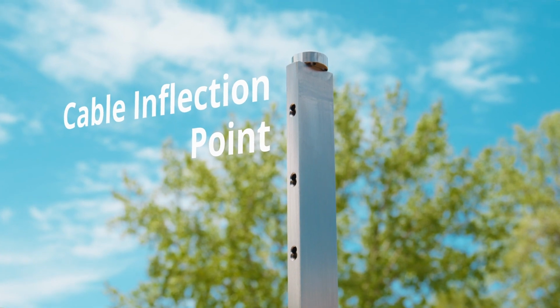Let's take a quick look at installing handrail on stairs. The biggest concept to remember when installing your stairs is where to make your bevel cut. For our tensioning post, that's going to be at the face of the post where the cable inflection point is. For the line post, we need to make the bevel cut at the edge of the post top.